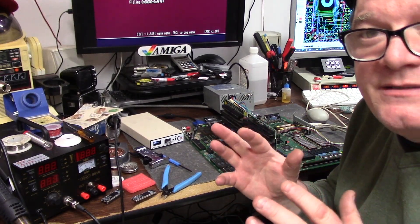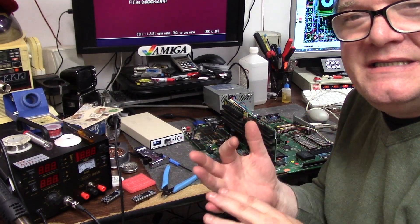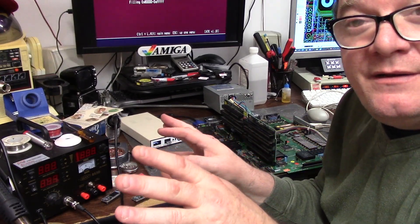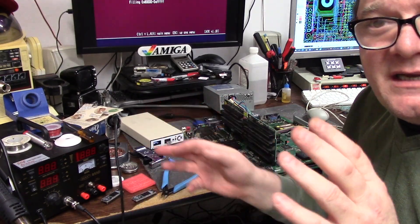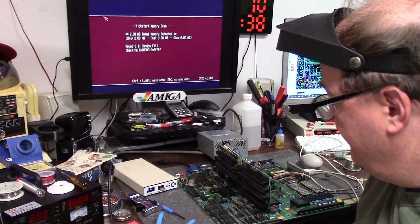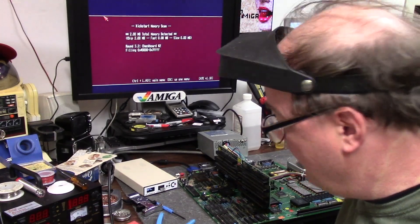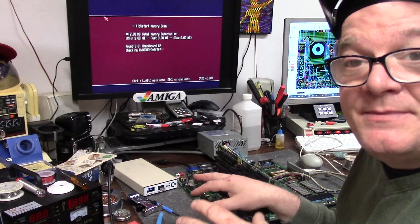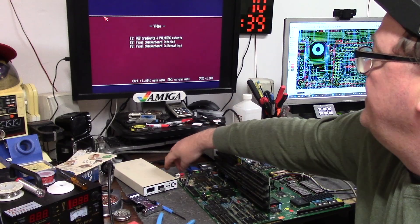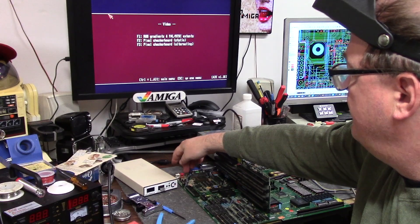What does glue logic mean? Basically you're using a CMOS or TTL-type 74LS chip to go in between the actual logic chips — kind of like set buffers or set voltages or all sorts of cool stuff. Usually they were used in older circuitry before CPLDs and FPGAs came out. Long story short: lots of chips on the board help the other chips do their job. That's called glue logic.